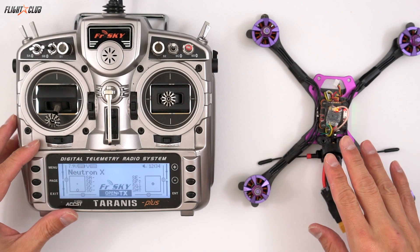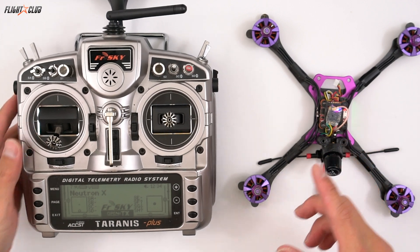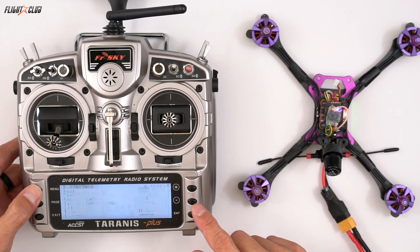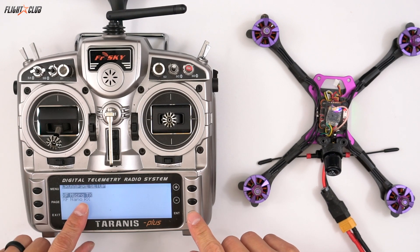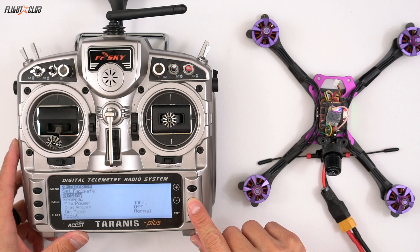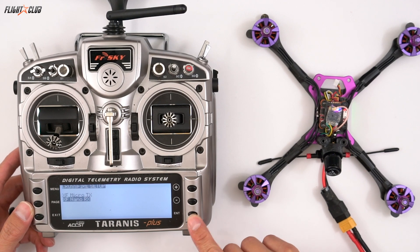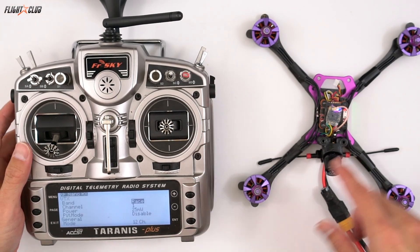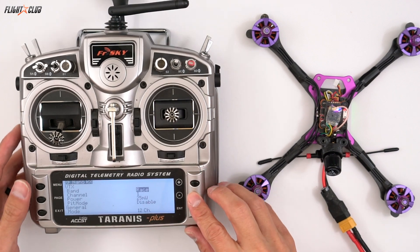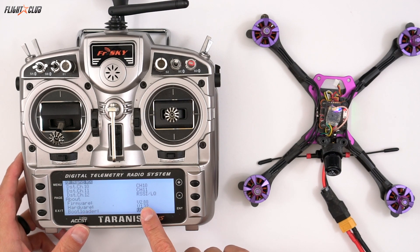To use the Crossfire method on the Pro 32 Nano, make sure your Crossfire TX and RX are both on at least 2.88 firmware. To find that, go into your Crossfire settings, page down, Crossfire, go into the LUA script, execute, and then on the TX you can select that and check the firmware. I've already updated it, and you can see it's on 2.88. By the way, once you update your Crossfire transmitter to the latest firmware, you have to rebind it to your Crossfire receiver — just keep that in mind.